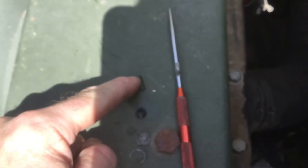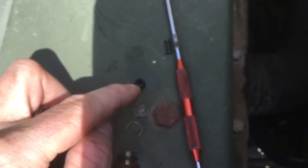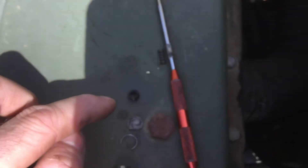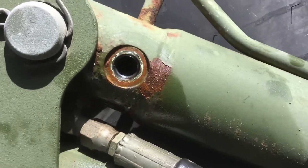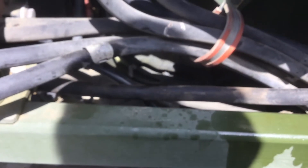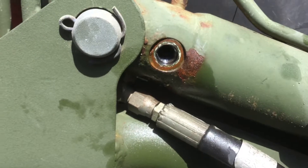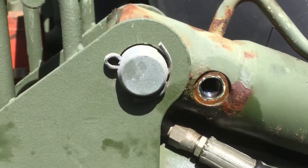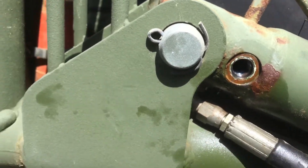You can remove that with an Allen wrench. The other side of that is this spring, which I really don't want to lose. The Allen head set screw holds a spring in. This is a collar inside of the hole — it almost looks like a helicoil. It is threaded on the inside and I am assuming it is threaded on the outside. It was probably put in with something like a helicoil tool. On the far end of it is a valve seat. On the other side of that valve seat is a little ball bearing, a little stainless ball. On the other side of that is a little spring.